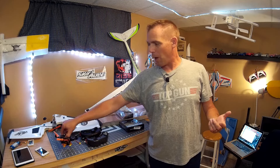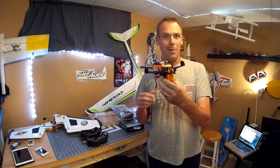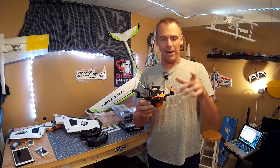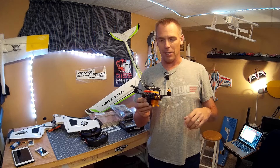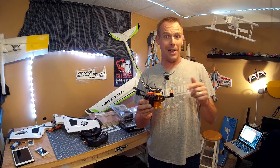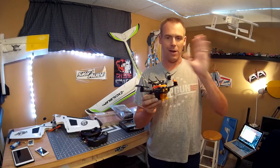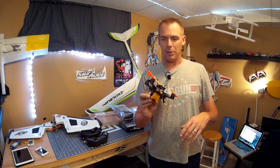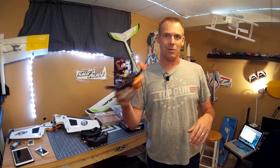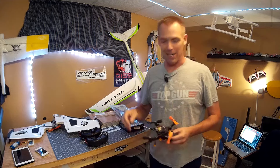I'm still working away on the MultiRC shenanigans, 150mm frame. I just kind of got busy with other stuff, so I've got to slap on the board cam and wire that into the FPV — that's a little bit of custom wiring. Mark from MultiRC just sent me all the PIDs I'm going to look for. I'm running CleanFlight on this guy; I may flash over to Betaflight, or I'll start with CleanFlight and do some tweaking. It does fly and I have flown it, it's just very sluggish and I couldn't do any rolls or flips — no shenanigans like I said last week.